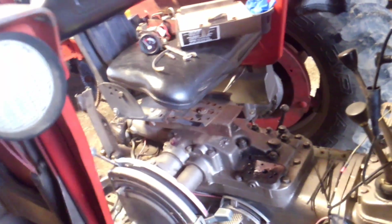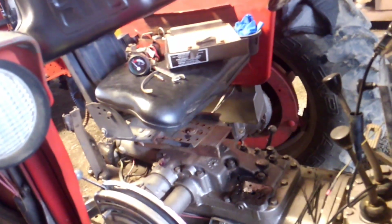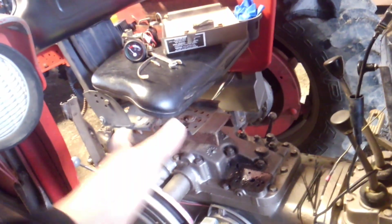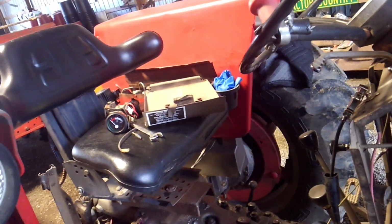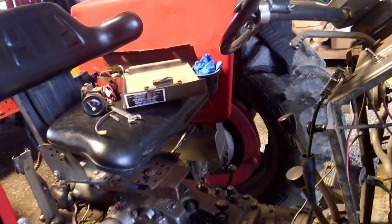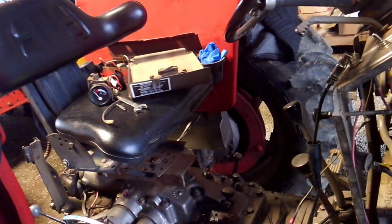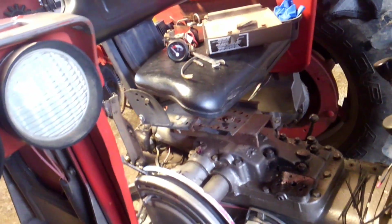And he put it in constant pumping, which basically just shoved the lift all the way up and dead ended the pump. And it blew the O-rings out, and I only had one set of O-rings, so we put one set of O-rings and just put a set of cheap O-rings on the bottom that we just had here. And it kept leaking down a little bit, so I wanted to get them fixed and put new O-rings in it, so I did that the other day.